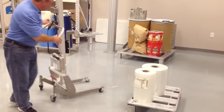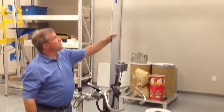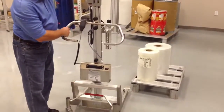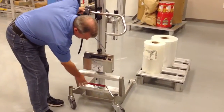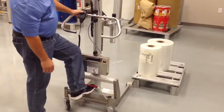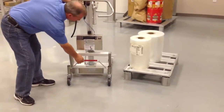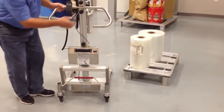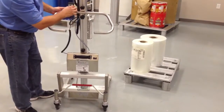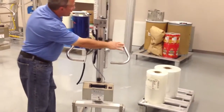Let's talk about the lifter real quick. This is a 20,000 series unit. It's rated at 275 pound capacity. You have the lift mast. Back here you have a 3-position brake system where it's locked, free, and then if you bring it all the way up, you'll see the back two wheels will lock directionally. Here's your power pack. Here's your adjustable handlebar. Here's your 2-button remote for your up and your down. And here's your control box for your expander, and I'll talk about that in a minute.